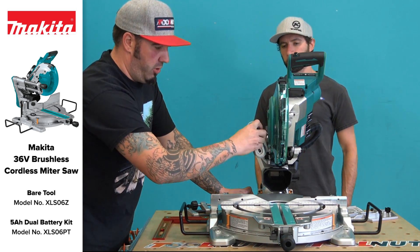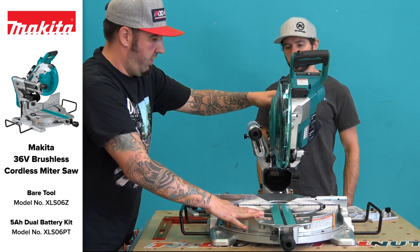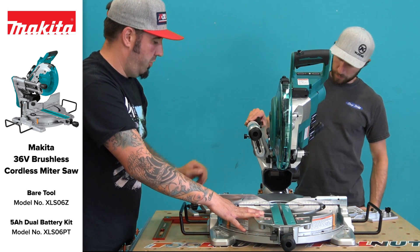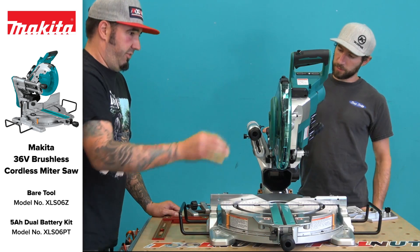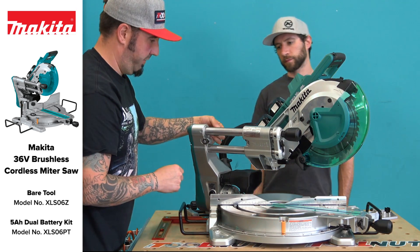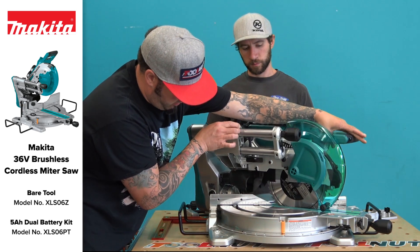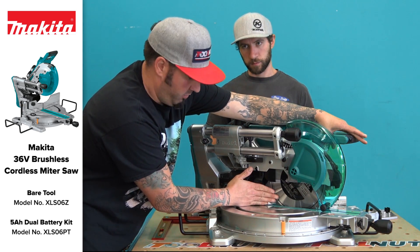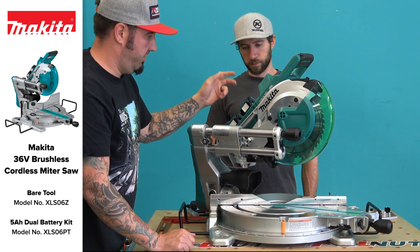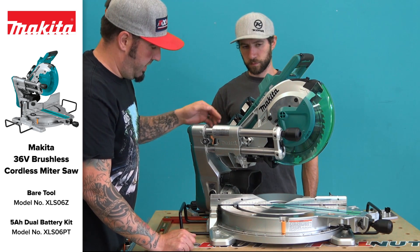There's a double lock feature — important for this saw. The slide mechanism is really smooth; they use good ball bearings. There's a little tab in the back that flips and stops the saw head, keeping it closer to the fence to give you more cuts. Just watch your fingers when doing these adjustments — I do have a live saw here. Either turn the saw off or take a battery out when making these adjustments. That lock is just to keep you against the fence and give you more cut capacity.